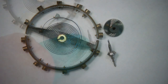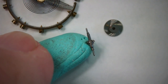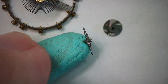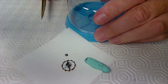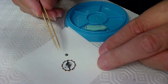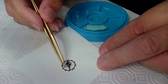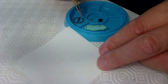I always store my old balance staff on a piece of Rodico so I can use it as a measurement tool while I'm cutting the new one on the lathe. Because I'm so paranoid about losing parts, I'll use a separate jar to hold the balance staff, the roller table, the studded hairspring and collet, and the balance itself, and I'll keep these out of the way until I need to actually use them for cutting the new balance staff.